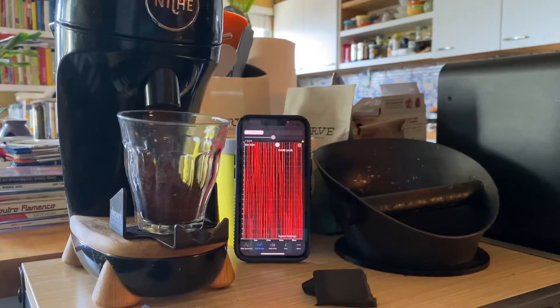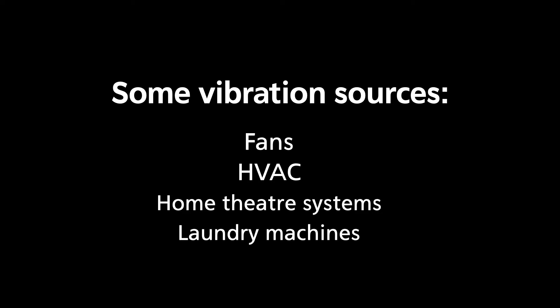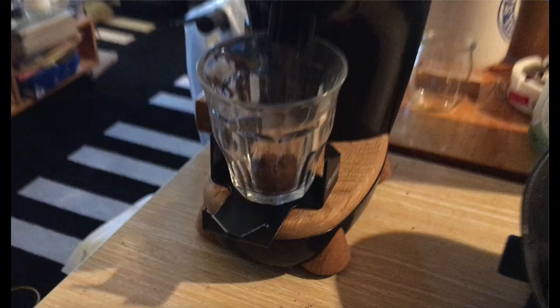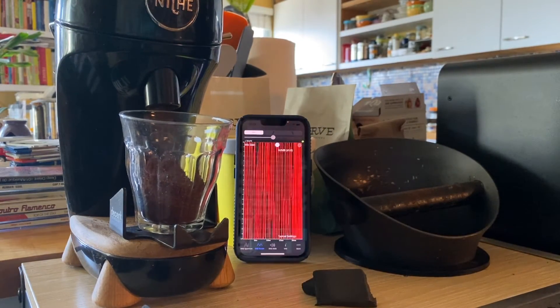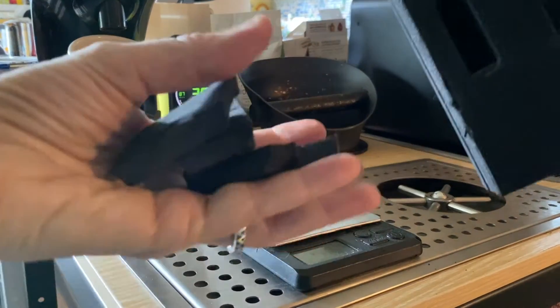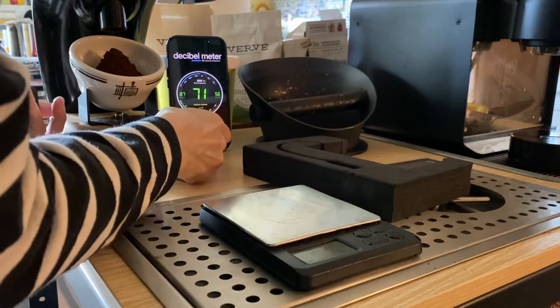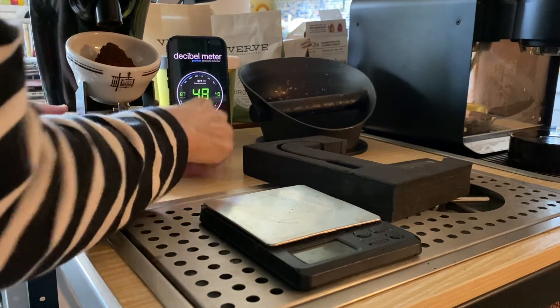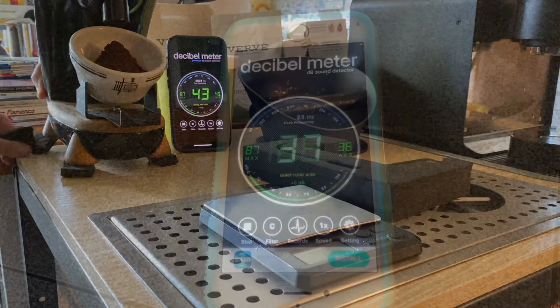We're going to talk a little bit more about that today, this time using a coffee grinder as an example. I get emails and messages from some of you about the types of vibration you get from your neighbors or from heavy-duty equipment like HVAC systems or washing machines. The coffee grinder had been sitting on the table with no pads underneath it, and I could feel the vibration in my feet when it grinds the coffee beans — so it's going into the floor. I found a piece of very dense foam, just some packing material, kind of like EVA foam — dense but with a little bit of flexibility. I cut the foam into pieces, put it under the feet of the grinder, and didn't really feel the vibration in the floor anymore.